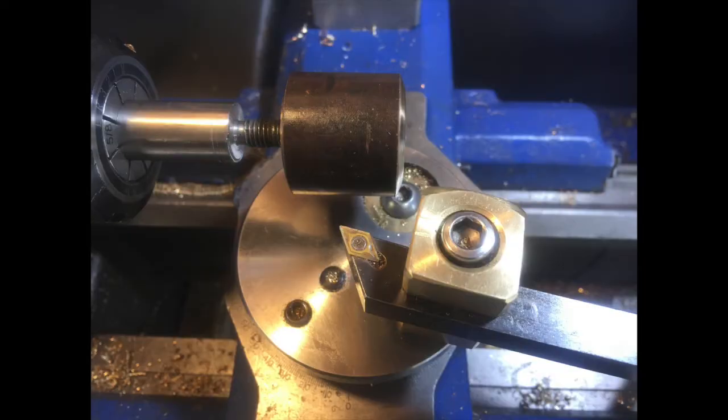The bar is mounted on a piece of threaded shaft, as you can see here, and the shaft is mounted in a collet — an ER32 collet. I found this gives you more room to work around the workpiece than a regular chuck does, though you can use a chuck if necessary. It's important that this runs true, so I turned this thread on the lathe to keep it perfectly concentric with the shaft — if you use a die, it's likely to come out crooked.